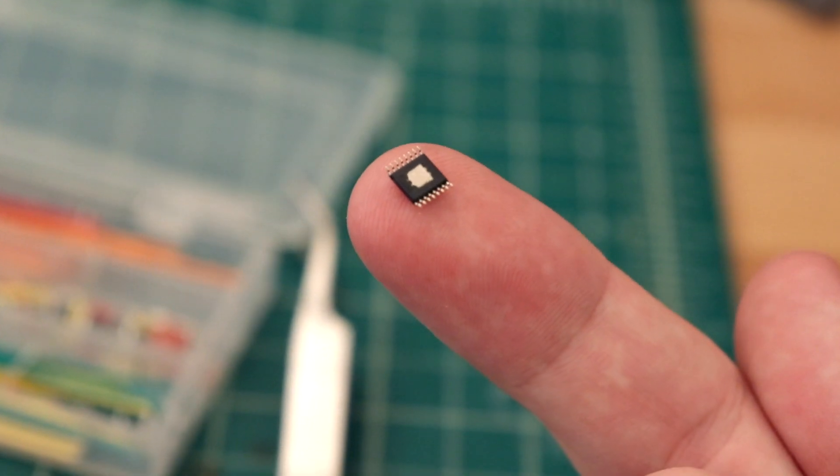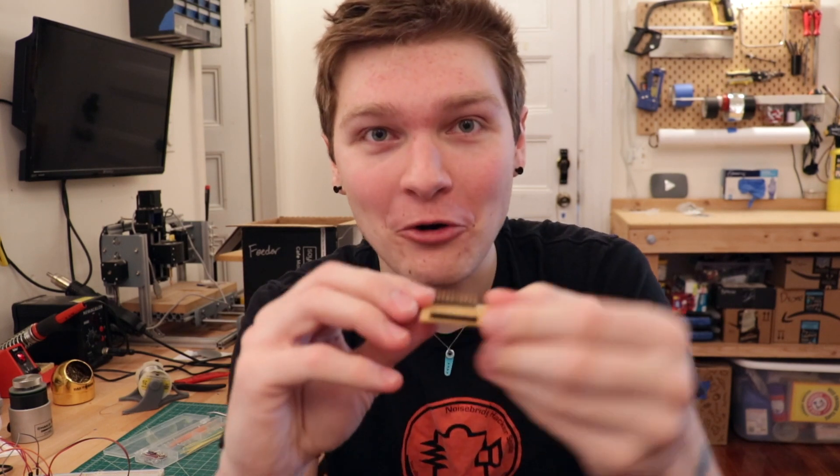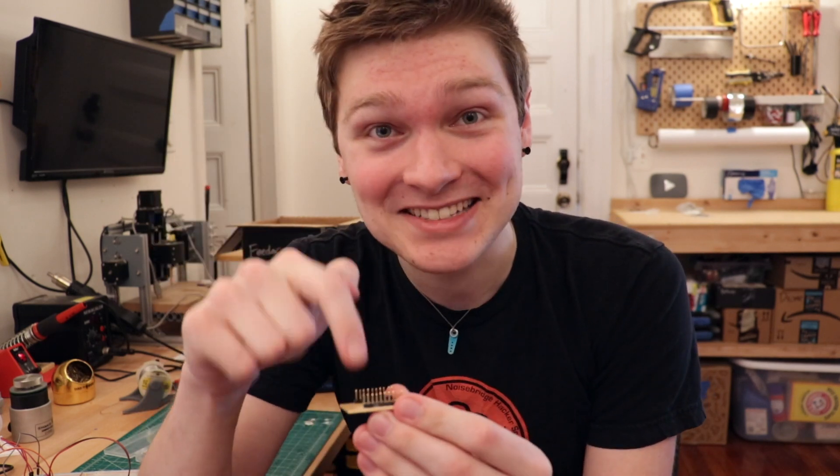I messed up. I was writing code for the Arduino to send a PWM signal to the motor driver to get the motor to spin, and it wasn't working. I went into the datasheet and found that not only does the pin labeled ground need to be connected, but there's also a pad on the underside of the chip that needs to be connected to ground. I'd already soldered it on, so I thought I was going to have to drill a hole through the bottom of the board to reach the IC. I'd assumed that pad was only for heat dissipation — nope, it's required for actual chip functionality. Always read the datasheet every time. Now I'm going to try drilling a hole through the bottom of the board to access that pad.